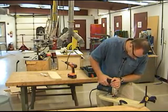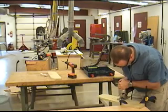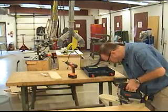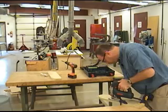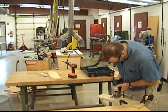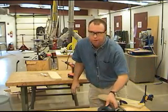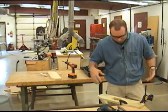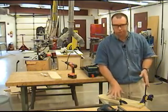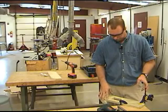I've got it positioned in one of the holes. I've made one cut — I can just rotate the piece and keep right on going. Wait for the blade to come to a complete stop before lifting up, and make sure the saw doesn't hit the board when coming up. The biggest safety concerns are making sure your hands are never in the path of the blade, and watching out for scraps that fall to the floor below your feet — those create tripping hazards, as you can step on them and lose your footing. Now let's review.